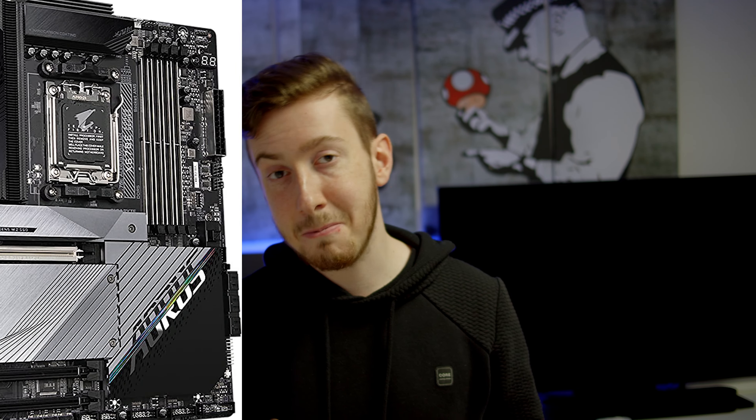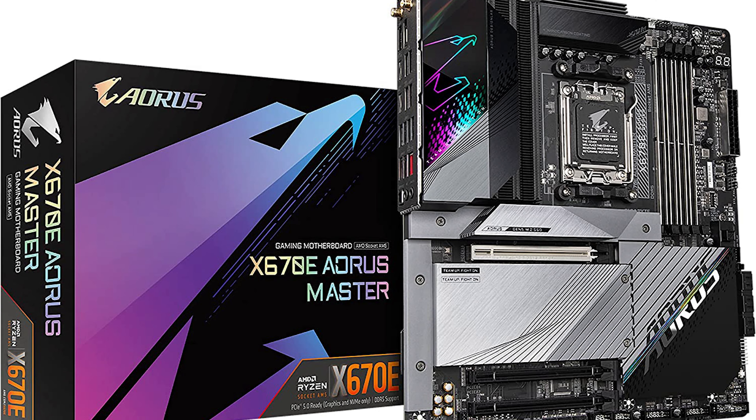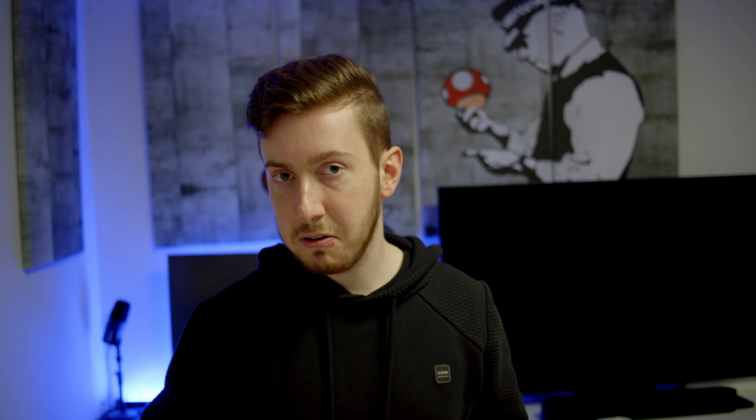There's a future-proof feature as well: the Q-Flash lets you update your BIOS without needing a CPU or GPU. This is especially nice if there are newer generations of Ryzen CPUs and you don't have the old one, or the old one is broken, but you want to use the mainboard for the new CPU — then you can upgrade it with this and it will work with the new CPUs.